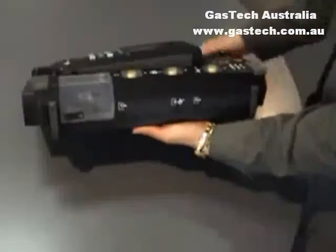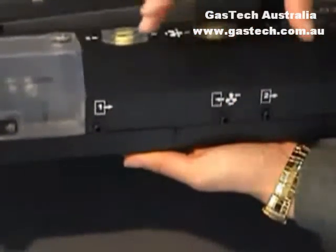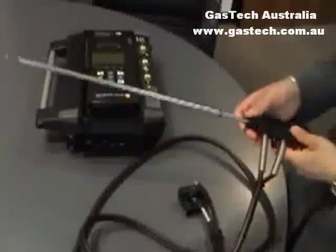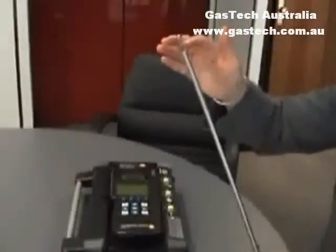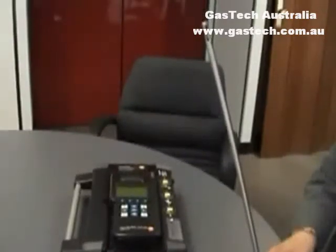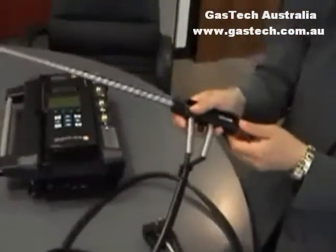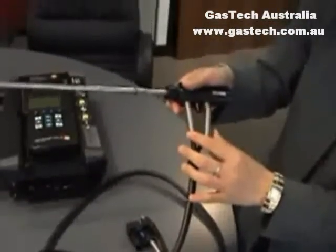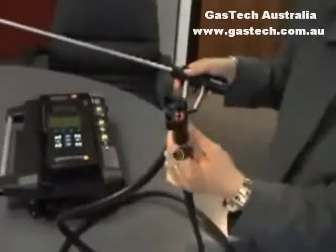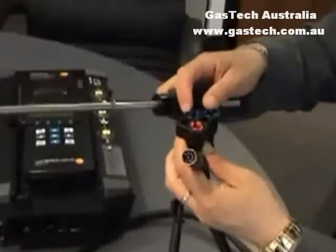The gas time is how long the sampling time is for, in minutes. If I press 2 minutes and press end, it'll save a 2-minute sampling time. The rinse time — pressing current shows what's been set, which is currently 5 minutes; press end to store it. Once you've entered every parameter for program 1, it lists out all your settings on the display screen. Press OK and the settings are saved — a star appears next to program 1 to confirm the settings are in place. You can then go through program 2, program 3 and program 4 in the same way.